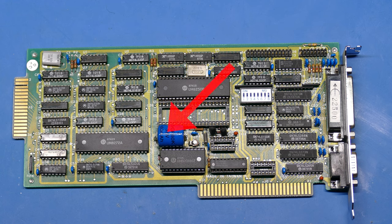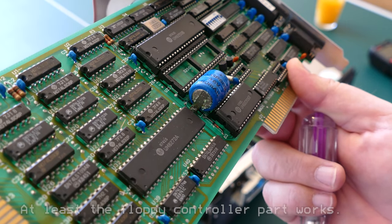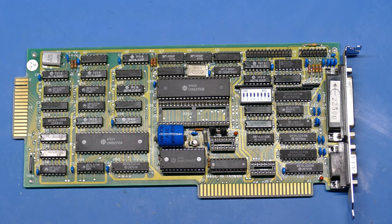We have this battery here that needs to come off. It's probably a nickel cadmium battery given the age. As we saw in the last episode, this battery is definitely starting to leak, although the card works. So first step is to take off this leaky battery.